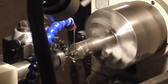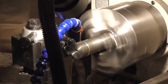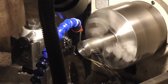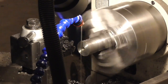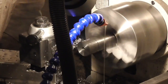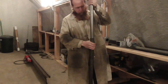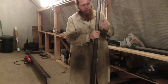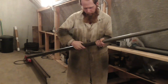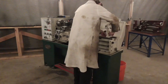The biggest challenge of making a rifling press is the need to apply a relatively large load to a relatively slender mandrel over a relatively long stroke. So to prevent the mandrel from buckling, I made a series of spacers that would ride over the mandrel inside a support tube, separated by springs to keep the whole assembly together. I cut some threads on the end of the support tube and made a threaded cap that would screw over them. However, the support tube was just a little bit larger than the through hole in the spindle of my lathe, so I had to weld it to another rod in order to cut the threads.